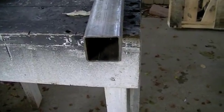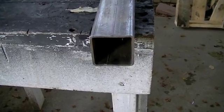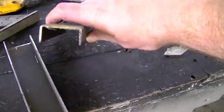I wanted to make one little note here. This is called HREW-Squared, which stands for Hot Rolled Electric Welded. You can see on the bottom — that little nudge — that's where it got welded together, that's the seam. So when you're doing this and you're going to be mounting something or drilling holes, you want to do it on the flat side where there's no seam. Cut on the side where there is a seam.